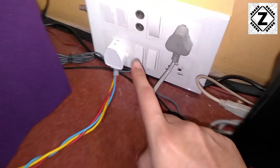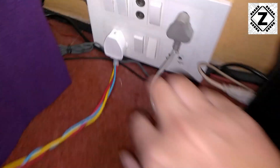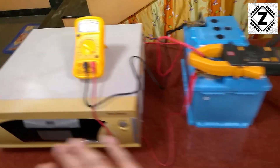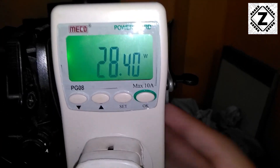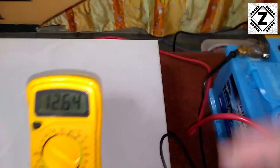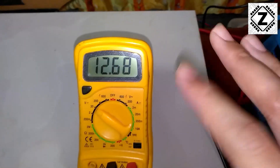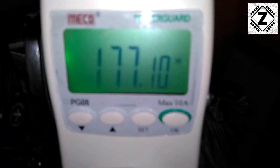Let me turn on this inverter. The flow of energy has started and in a few seconds we'll find out what kind of energy is delivered to recharge this battery. It takes a little bit of time to analyze the power, then it starts stepping up the charging amperes. The battery has begun charging — the clamp meter is showing 10 amperes being given to the battery through these thick inverter wires, and the battery voltage has immediately started going up from around 11.9V, climbing to 12.6–12.7V.